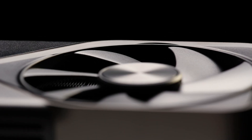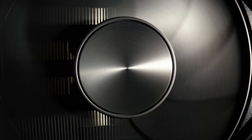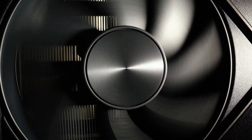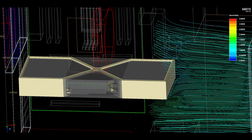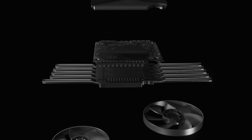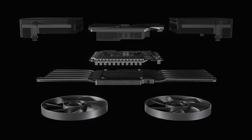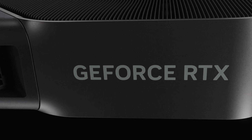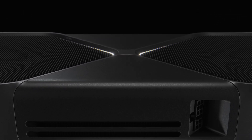This normalizes the pressure drop but increases the effective fin area below the most effective part of the fan. When we think about an axial fan, the velocity of the air coming off the fan is not the same at the hub as it is at the outer diameter of the fan blade. Although the angular velocity is the same, the tangential velocity is different and increases with radius — your blade is traveling at its maximum velocity at the outer diameter. The fans take cold air in from your chassis, blow through the fin stack, and exhaust out over the GPU. It's really a fully integrated thermal, mechanical, and electrical solution — the cooling solution is the entire graphics card.